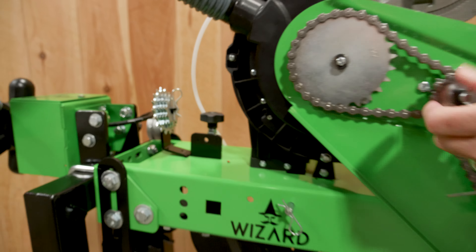Once we get into the vacuum part here, the plate slips onto this. But before we get to that, you need to observe this piece right here — this is what's designed for seed singulation. There's a lever on the back side that pushes it closer to or farther from the holes. Depending on whether you have larger seeds like sunflower, corn, bean, or peanut, you'd have it farther away; for a smaller seed like beet in a smaller hole, you move it closer. As the plate spins, this helps drop any doubles so you avoid doubles and triples. It's easy to adjust and easy to remove — it has a magnetic back so it holds against the plate very nicely.